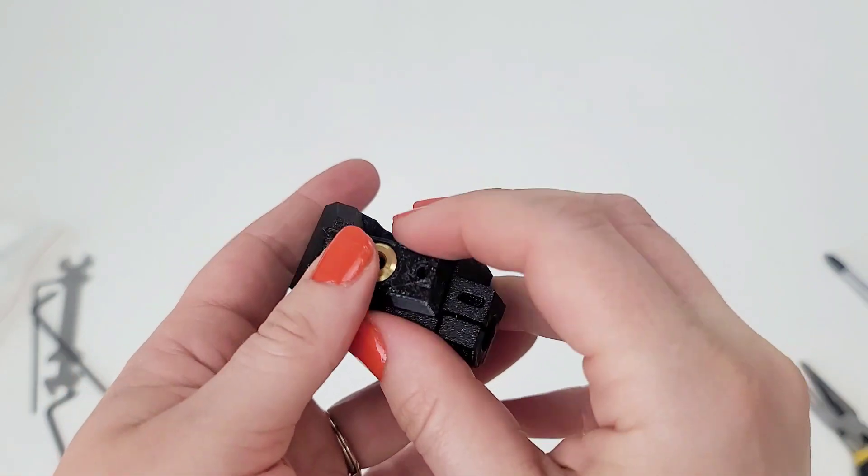Now we're going to cover the blades with the blade holder. Verify the blades are still seated perfectly in place while attaching. Fix the blade holder in place with the M3 by 10 screw — it looks like it's got a little notch over the back piece there. That's it for this chapter — this little guy is done. The next chapter is Chapter 6, the pulley body assembly. Thanks for watching!